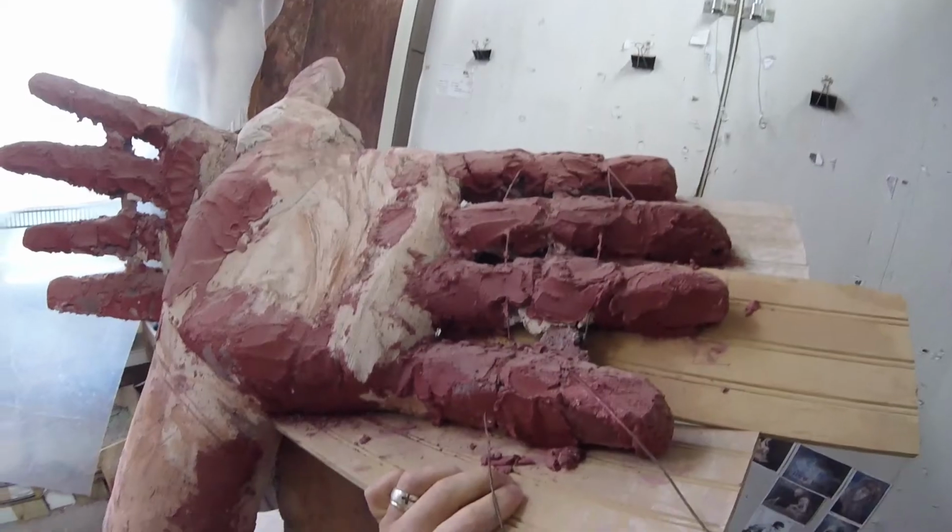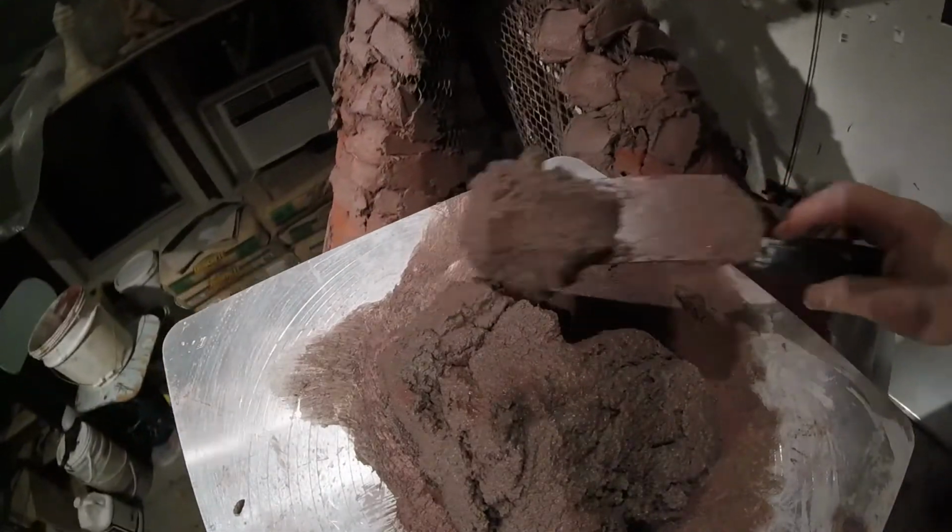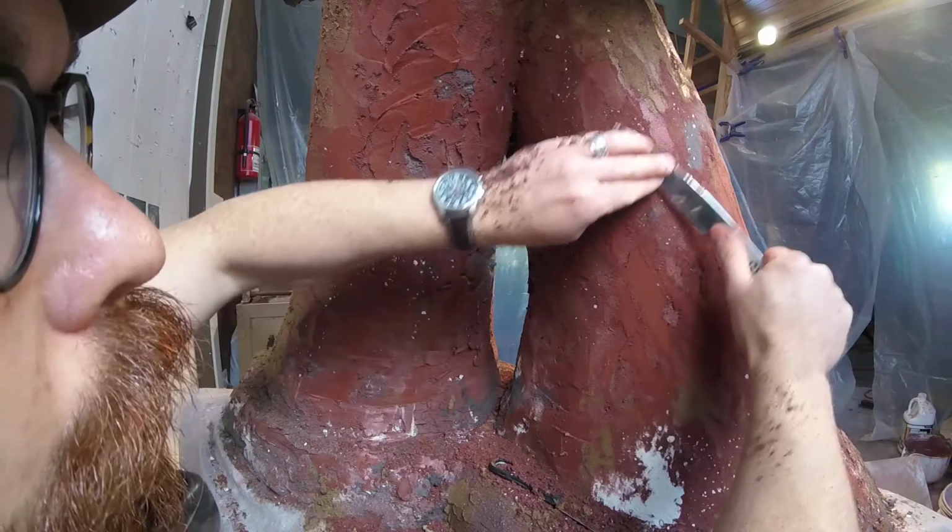That was an interesting aspect of this project. I don't have a lot of firsthand experience sculpting cement. So, like many projects of mine, I had a lot to learn. I called my uncle one night. He's the one who owns the concrete plant, and I just wanted to pick his brain about cement. I wondered if he knew any mixes or had any advice. He brought up some things I hadn't thought of, like weep holes in case frost or condensation ends up inside the sculpture. So I've engineered in some channels at the bottom end so that any condensation will run out. He was really hesitant though.